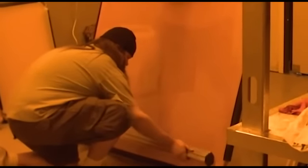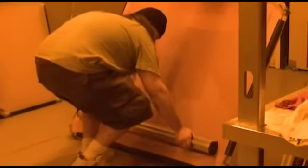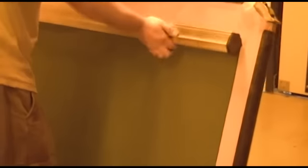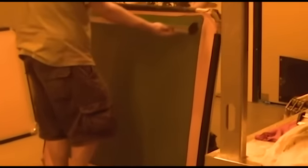The emulsion and the screen reclaiming is different for the oversized screens, and that has to do with the water-based inks that we use. So we have a whole other set of chemicals for that. All emulsion has water in it, but this has less water concentrate, so it stands up better against water-based inks. There's also an additive I put on it — basic trans — which is a permanent emulsion that should not break down through water-based inks.